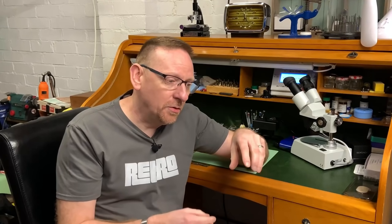And therefore, you are ensuring that that works first, because if you just steam ahead and build all the chronograph works on the top, the chances are, if there is a problem, you might overthink it and think it's the chronograph or something else. Your fault diagnosis can take ages, when reality is, we're just doing a step by step. So try and do it as a normal watch to start with. If you're happy and it's running okay, then we can proceed to the next part.